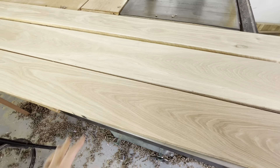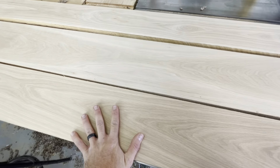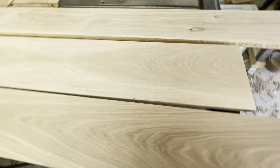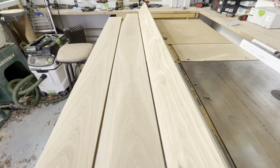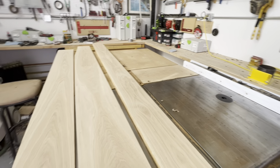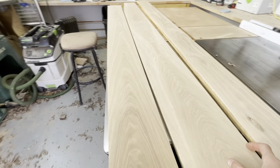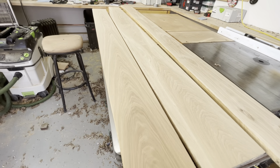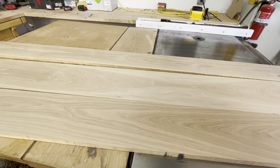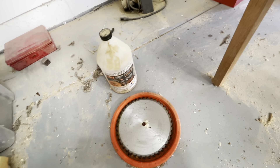All of these have been drum sanded at 120 grit, and that's about where I want it right now while I work the wood. It's pretty close to its final dimension. I don't want to go any finer than that because I'm probably going to ding it while I work with it. This is S3S so we have one square side, one rough side. The next thing I do is rip these boards into square planks, then rip three-inch wide pieces from each of them so the face of the shelves appears three inches thick — giving the look as if you're using a three-inch slab.